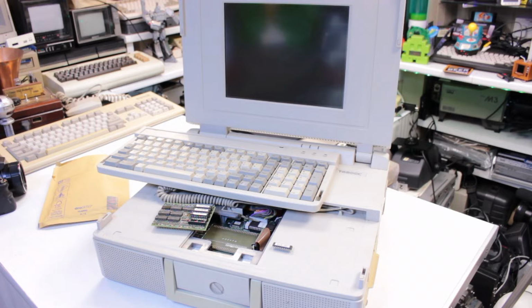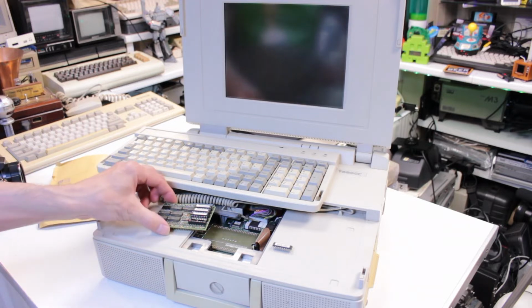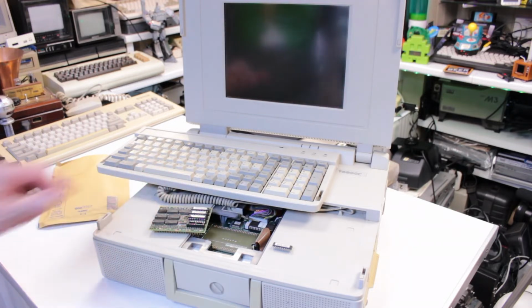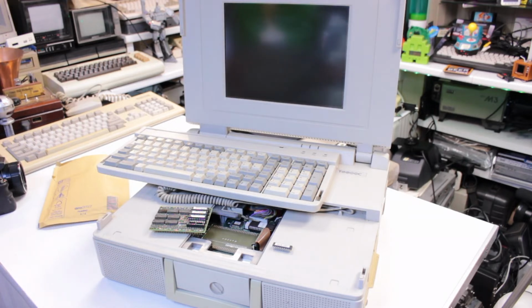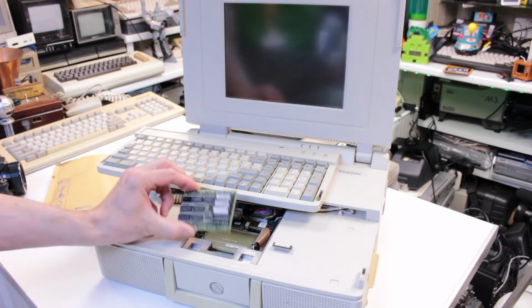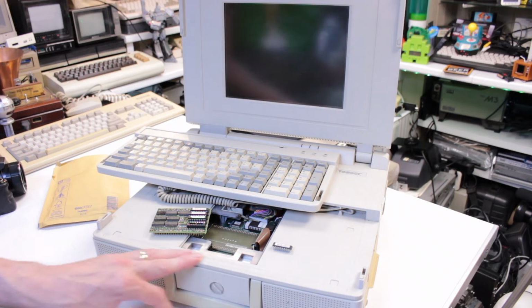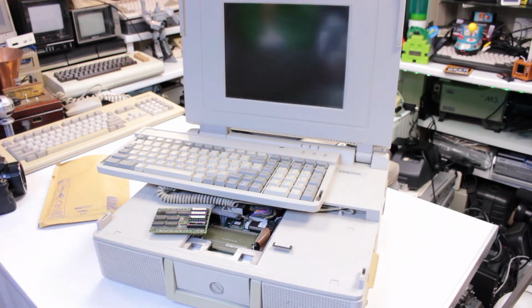I have tested this with some benchmark software as it is with that chip missing, and it's not registering basically, it's not picking it up, it's not giving any higher point score in TopBench, and CacheCheck, the DOS program, is not even seeing it, it says it's not there. So the Toshiba is seeing it in the BIOS, it's saying it's installed, but software is not. So he's sending me another chip, but me being the impatient person I am, I can't wait that long.